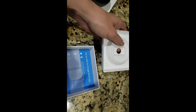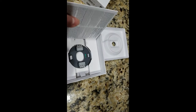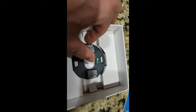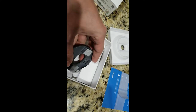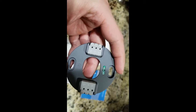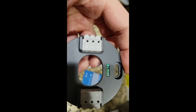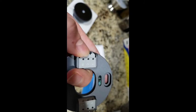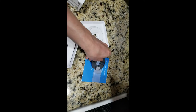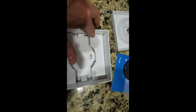Underneath that, we've got some paperwork held together with some plastic — we'll put that aside. And what do we got underneath here? It's the mounting plate. It comes with a level built in, which is nice. The top and bottom are set up to put a screw into the wall, either to a drywall anchor or if you get into some wood. The wire connections are on the left and right — that's what you put your thermostat wires into. No screws or anything; they're just spring clip type. Make sure you get it all the way in and give it a tug to make sure it's locked down.